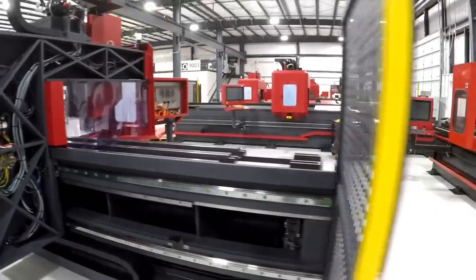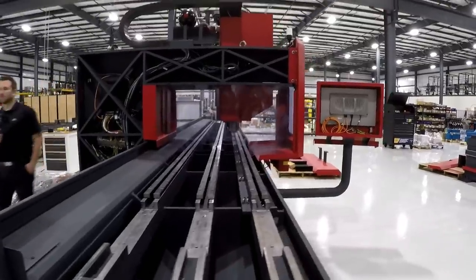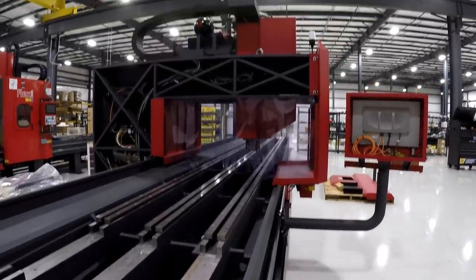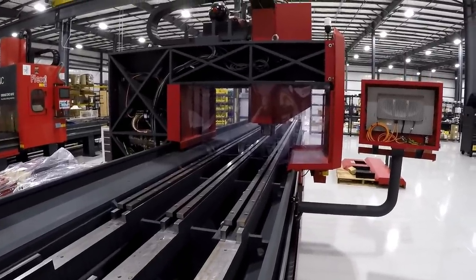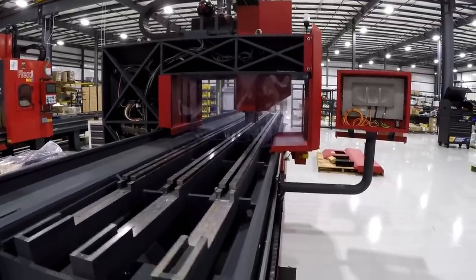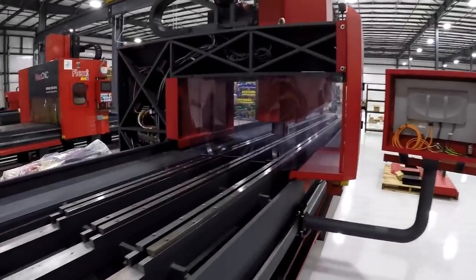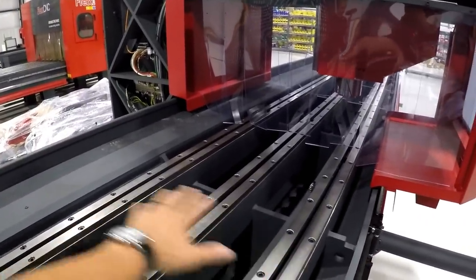One of the cool things that we do is when we get the machine set into the customers, you'll see the rails up here on the top. Yep. So just standard T-slot rails on here for fixturing. What we do is we actually take the spindle itself and we machine those rails down. So they'll run a face mill all the way across and make sure we maintain that perpendicularity all the way down, or maintain that tolerance. So you'll get the machine, install it at the customer's facility, get it level, and then machine the rails so where it is perfect. Correct. And all of your subplates, all of your fixture plates, your vices, all will mount right here on these rails.